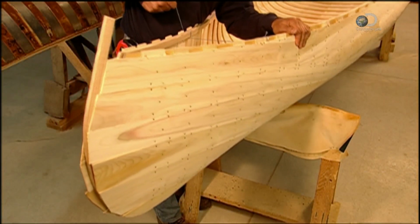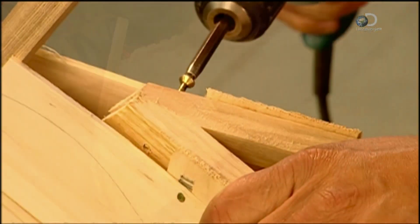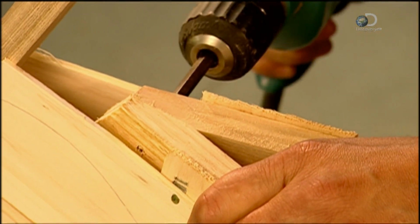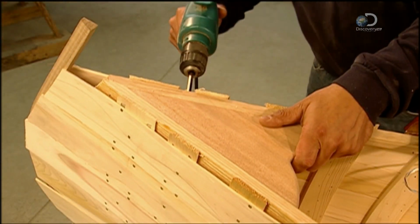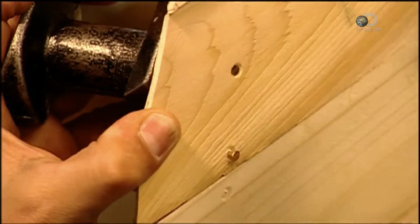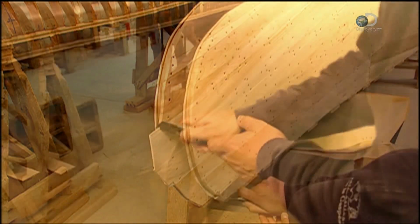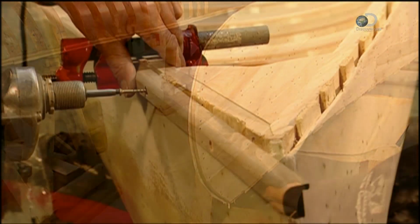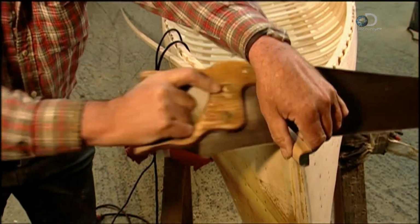Next, a nylon string is tightened between the gunnels, bringing the boat's extremities together. The tips of the gunnels are joined with a screw at either end of the boat. Triangular pieces of mahogany are installed. Then the ends are trimmed and closed off. Next, 2 more gunnels are attached with 44 screws to create the outer rim of the boat.